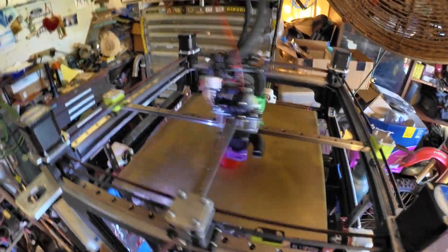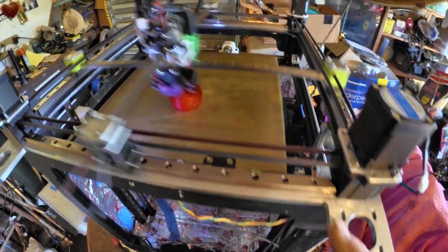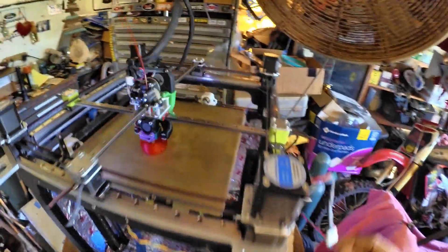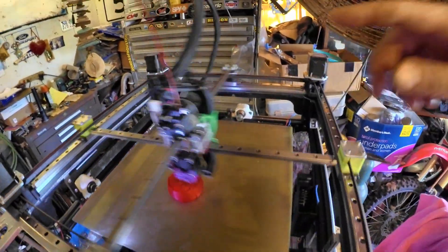The only reason it's in my garage now is to install this top plate — it took quite a bit of work. This rail core top plate was actually too long; it came out about another inch or so in the back, and I had to basically cut it off in the back, flip it 180 degrees, and re-weld it.